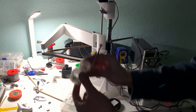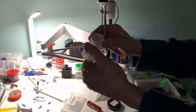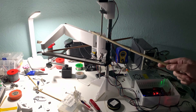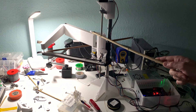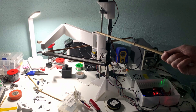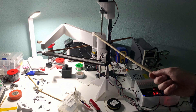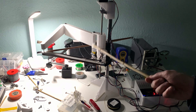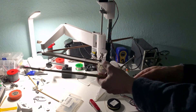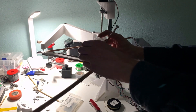Here is the bearing from my earlier video. I have it tightened — harder to turn, but pretty stiff — and I think I'm going to experiment with that to replace the pivot bearings. The small bearings in a typical 3D printer are not very stiff. I'd prefer to use this entire length to provide stiffness. And it allows more range of motion — you can turn 360 degrees coming to each other side without crashing into itself.